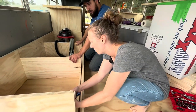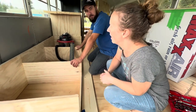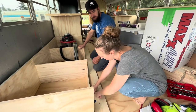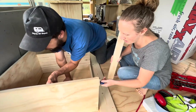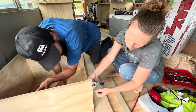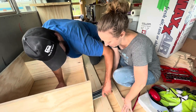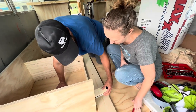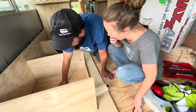Okay. So you're cutting it down to 3¾, and a 1x3 is 2½. So you'll still have a 1¼ thickness on this, sticking under the notch, to let this pass through. Oh, okay. But you'll still have to cut it out because this moving part is most of the width. The fixed part though. Oh, I see. You're resting on this notch, on this wood. This thickness plus this thickness. So we need that measurement, but on the back end, we only need to notch out just for the slide. Just the slide.